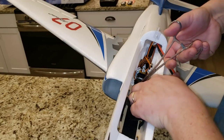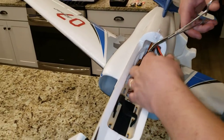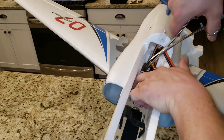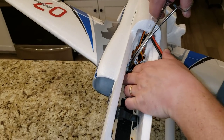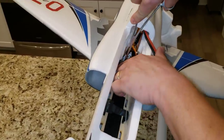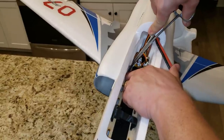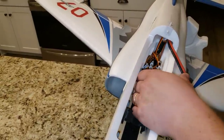Here we go. So I'm going to grab this antenna and rotate around. You see, I'm just trying to be very gentle so I don't kink it. Then I can take that one gear wire that needs to drop down, and drop it over here, next to this cabinet of the receiver. See what I'm doing? I'm grabbing that with the forceps, and that allows me to squish that in sideways. See? Then that gets out of the way totally.